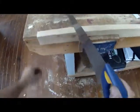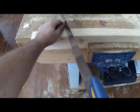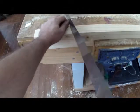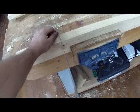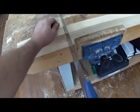When you go to cut your job, you should always cut it from the top facing towards you, so you don't chip your edge away. You also cut down to the line, cut down to the line on this point — don't go on the pencil lines though, because if you do, you could end up making it too loose for your leg and you'll have to modify your leg.